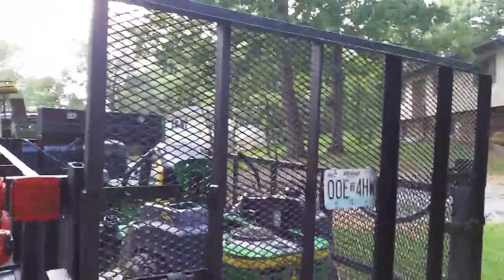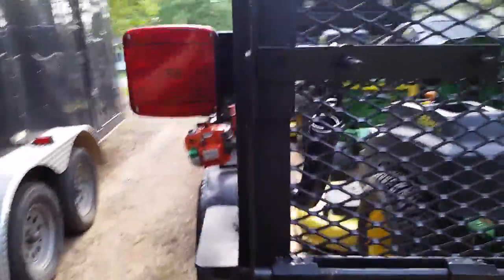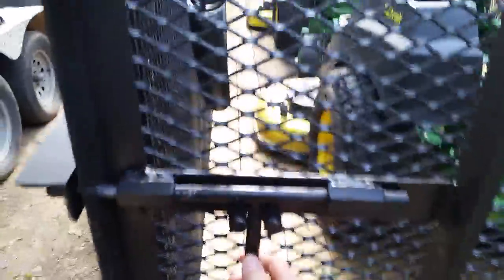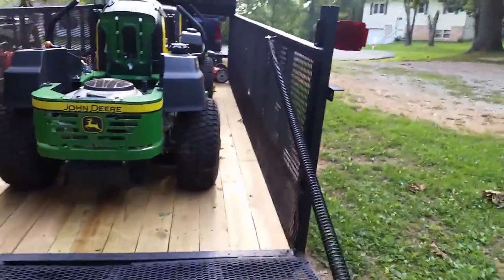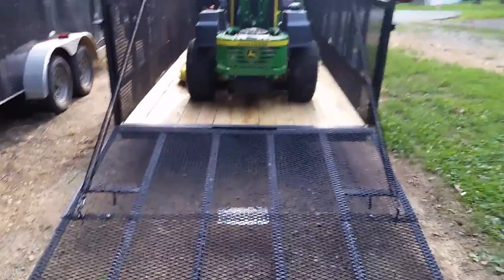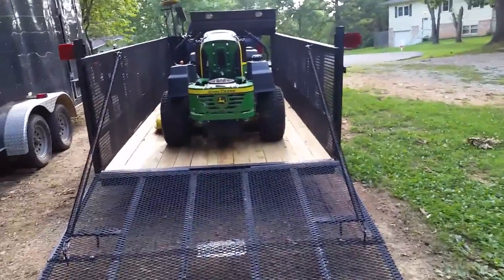This is something that my son and I worked on recently on the gate. You can see it's a pretty good size — I think it's five feet tall and six feet wide — a ramp gate, and we made these bolt latches. Really turned out nice, works really smooth as opposed to pins and other latches that I've seen. We added garage door springs to the gate and made a really nice lift gate. With one hand you can open or close this gate — those springs give it a really nice lift assist.